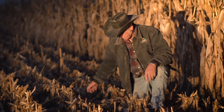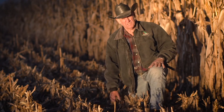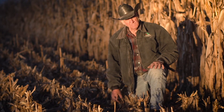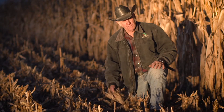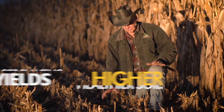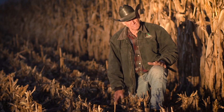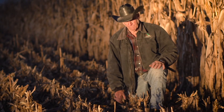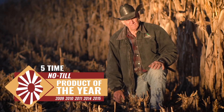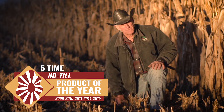Of course if you're conventional tillage and want to run any kind of tillage equipment, you can run anything through this. A year ago I planted 120 acres of wheat with an 8-inch spaced no-till drill right in the corn stalks, the day after the combine left the field. There's just nothing here that's going to interfere with the tillage tools, nothing that's going to drag up — you can run anhydrous applicators, about anything you want right across the field. It's a good, true residue management system using that Calmer BT chopper stalker.